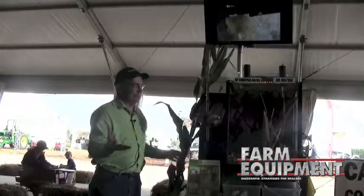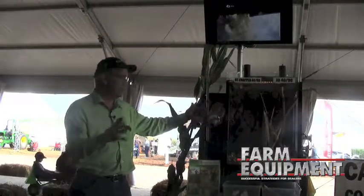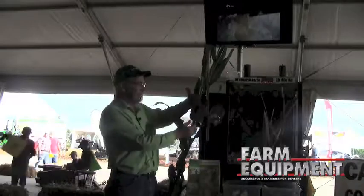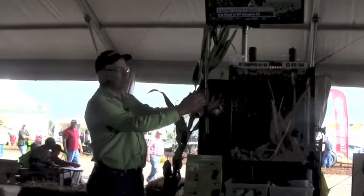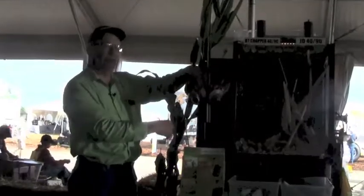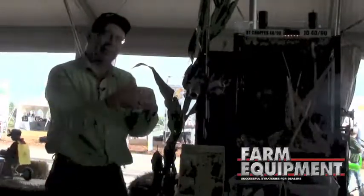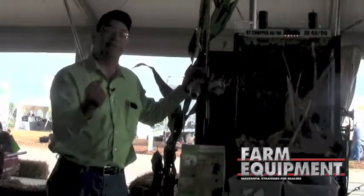we have the opportunity to bring the plant in, and as we run it through the rollers, chew it up into little pieces. But in order to get it into the rollers, in our opinion, we have to have a feeding chamber or a revolving window. And what that means is that we have shortened some of the length of the blades so that as the stalk roll rotates, you can watch the corn stalk follow back on the spirals, and then we have shorter flutes in this area, and then it allows that corn stalk to come into this corn slot. And once it's in here, then the knives are going to come over the top.